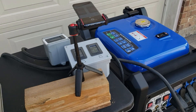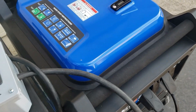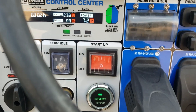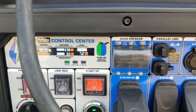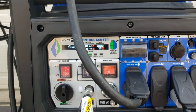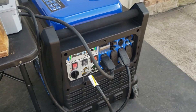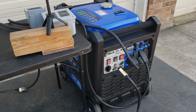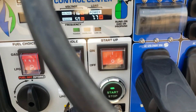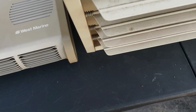Let's turn on this heater — and that's also on eco mode. As you can see, you're pulling almost 7200 watts. That's the max rated load. No overload light yet. Right at 119 volts — 7.2. Let's try to put a little more on that. So the Duramax will run max load on LP. 500... 7700. And that's it. That's good — that's what you guys want to see.